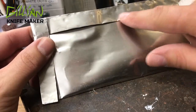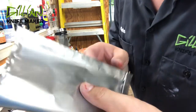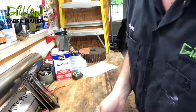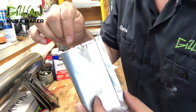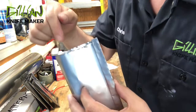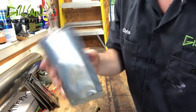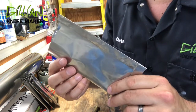I did double crimp these edges. I told you this foil was sharp — I don't know where or how it got me, but I'm starting to see blood on my foil, my hands, and my tooling plate. I'm going to go wash my hands, find the cut, and put a band-aid on it. What we're going to do next is put argon gas in the foil. I double crimped the edges and now I'm going to put argon gas inside the little pouch. The specific weight of argon is 1.38 — it's heavier than air. When you put the argon gas in there, treat it like a glass of water: don't spill it, then reseal it quickly and you'll have an inert atmosphere inside the foil pouch.